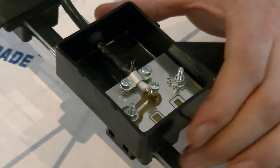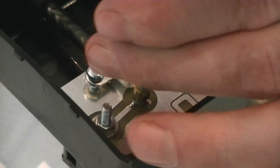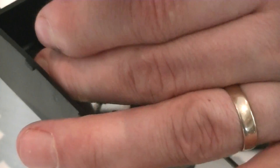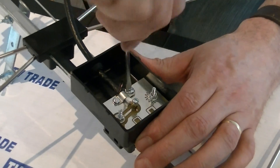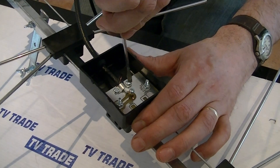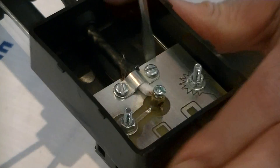What we have now is the core wire feeding into the centre here. I'm going to use a flat head screwdriver to screw it in — for this part you can actually use a Phillips head. For the saddle part here, we tighten in the earth wire. The important thing is we want it tight but also we need to make sure neither the earth nor the core wire are touching each other, because if they are we're going to have a lot of interference. We can see some core wire there, so we know we'll have a good electrical connection.